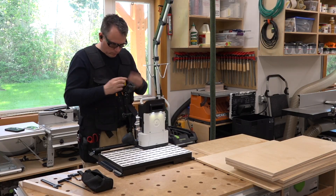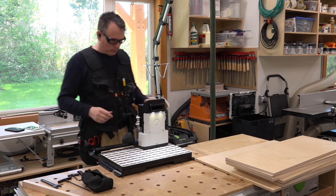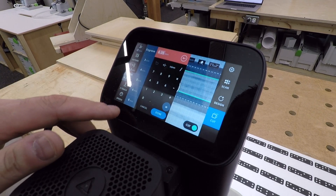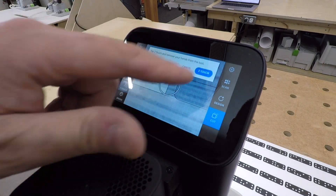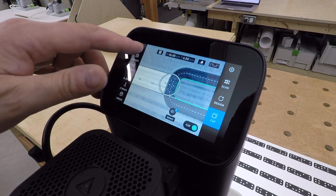I created two files. The one I'm using here is the shelf tenon file. I designed a 50 mil or 2 inch tenon that is inset from either side of my 12 inch or 300 millimeter shelf. The tenons are inset also by 2 inches or 50 millimeters. This will provide plenty of support and allow for a screw on either side of the tenons.